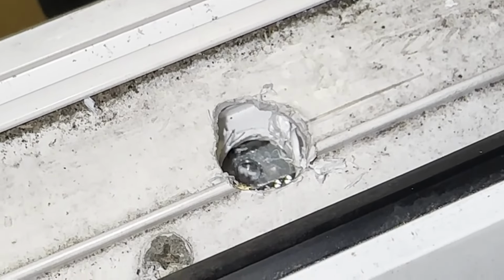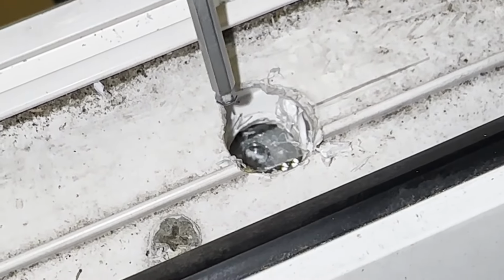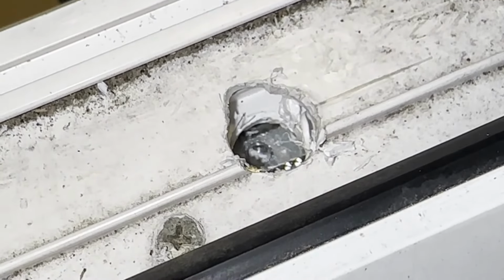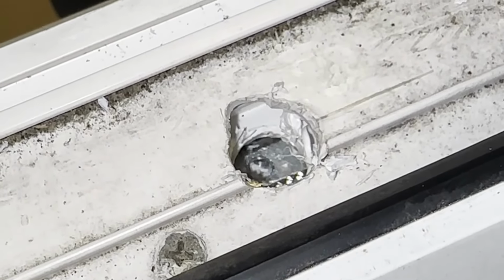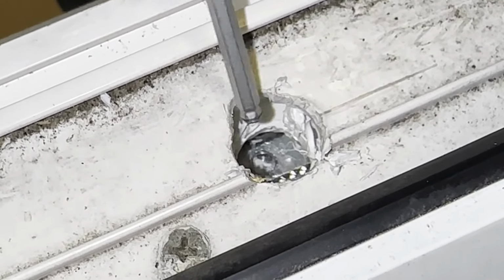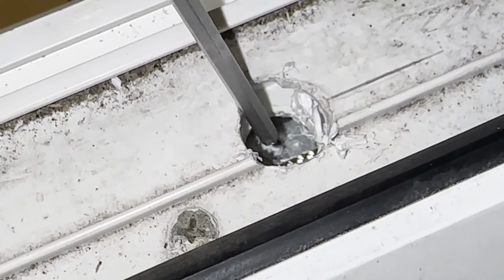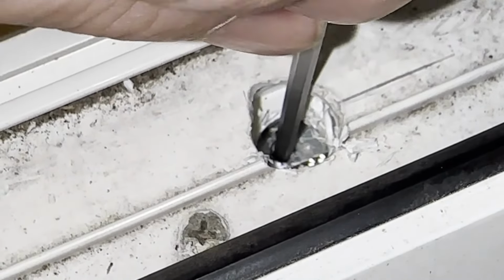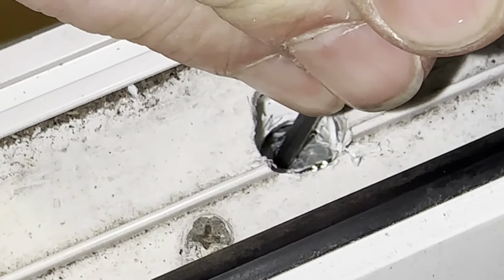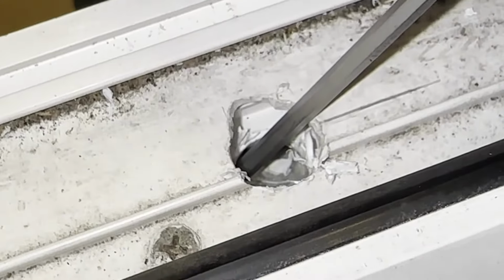So as you can see looking down the hole now, there's the 4mm hole that we drilled right at the beginning where we were putting the pilot hole through. We've taken that into the back of the metalwork, and now we offer a 3mm Allen key into here, and you push the mechanism over, using that Allen key, and remove it, and then theoretically what should happen?